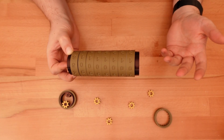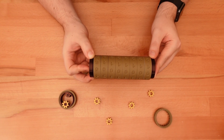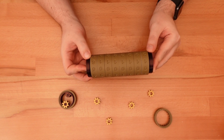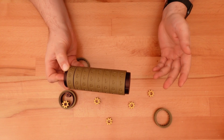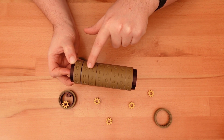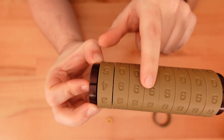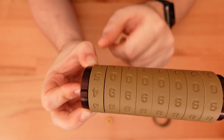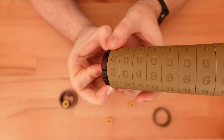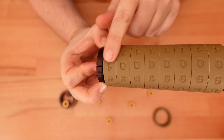All right, we're out of threaded rod. If we include the actual rollover, this counter can reach one billion. At one rotation per second, that's over 30 years — so I'm obviously not going to be able to test that fully. But what I can do is check the last rollover, which engages every single index gear in the device. We are currently at nine nine nine nine nine four, and if we increase that slowly... all the way to nine, and there we are: zero zero zero zero zero zero zero one.